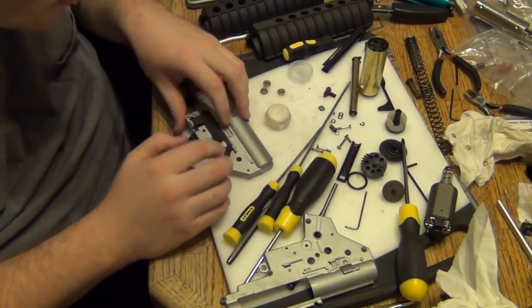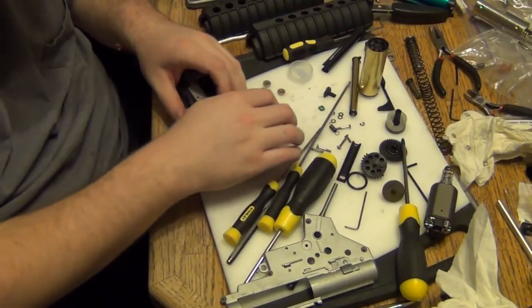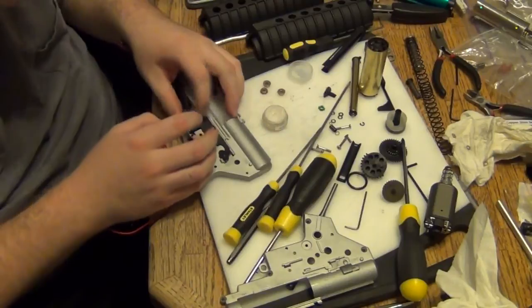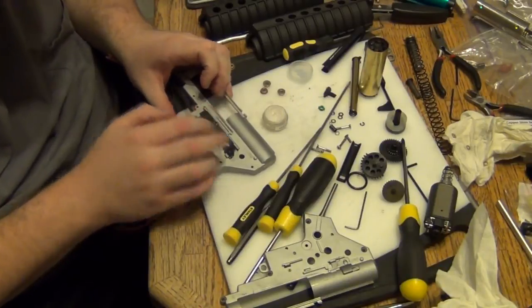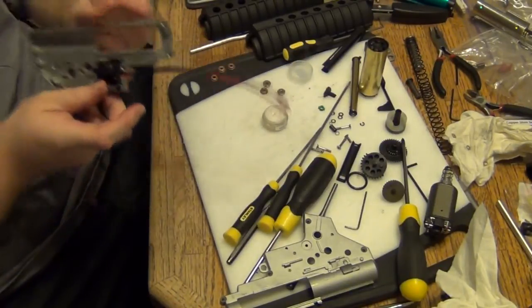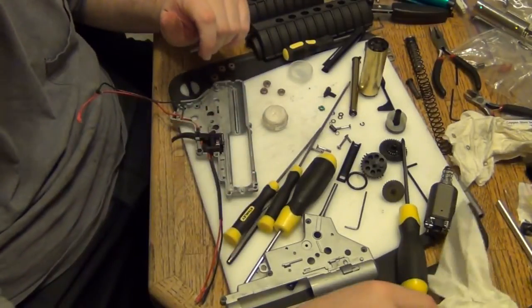You start at the very first gear, which is the one in the middle, the second one. I forget the name. You remove all your bushings first, then you put down one bushing at that location. You can grease it at that point if you need to. I usually don't grease everything till I know at the end what's perfect or what's not. But you'll see me pretty soon putting that second gear up there.